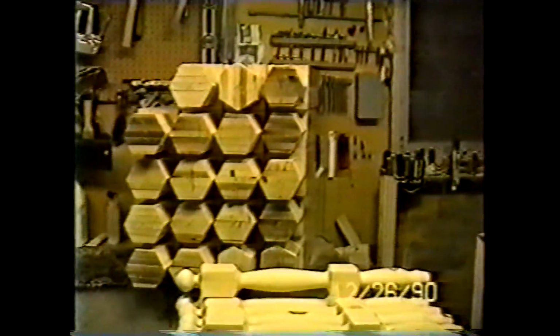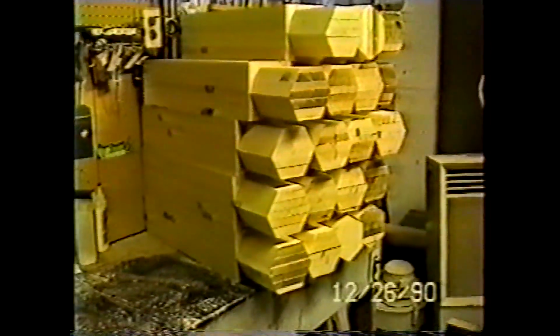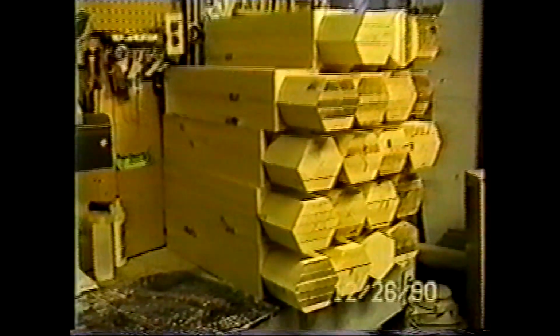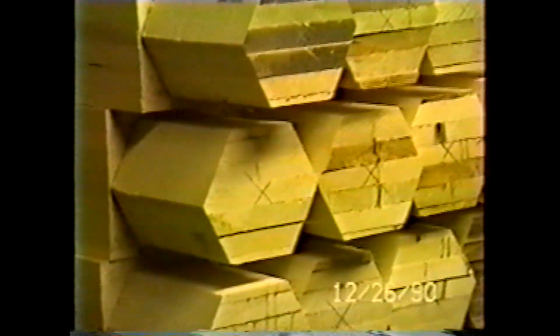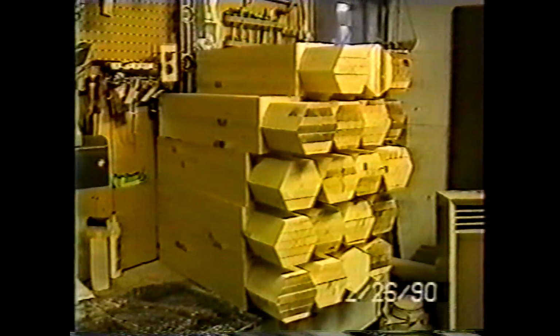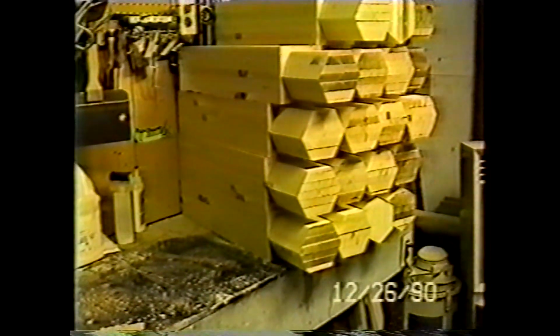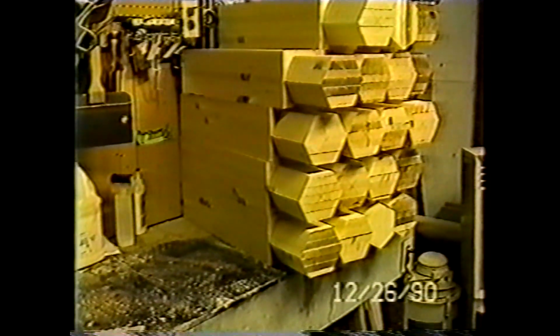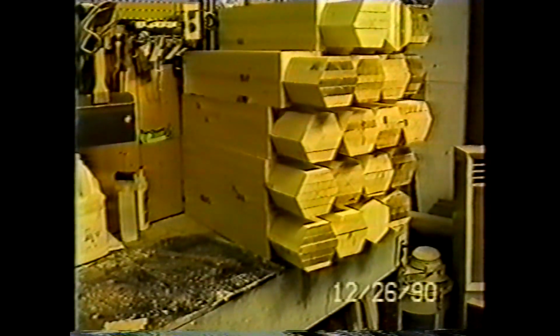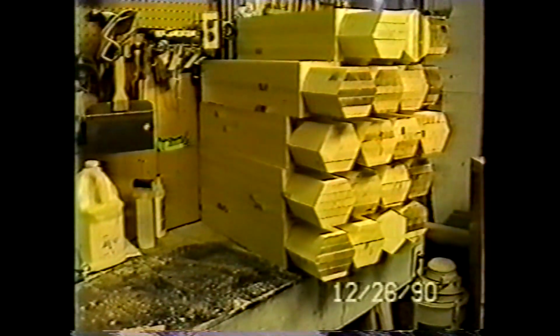And these big babies up here are for the card tables, for the round tables. Got 18 of them, and one extra there. Make an extra of everything. I got them bottoms shaped out like that. I'm putting three Queen Anne legs on there, so whatever kind of floor you put it on, it'll always be still, steady. Now they go in the lathe, and the rest of it will be turned down.